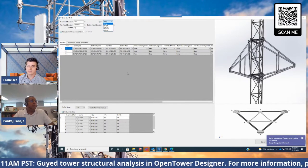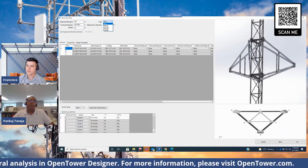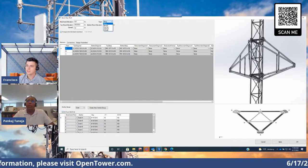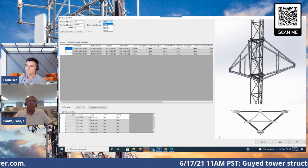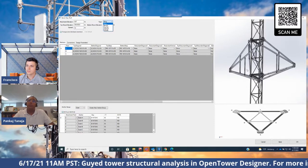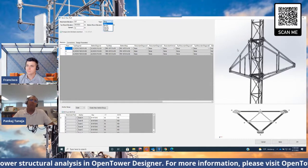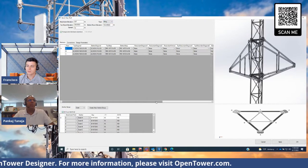Now think about it this way: we have wing style. Wing style has a top diagonal and a bottom diagonal, right? Then I have a top strap member where the upper diagonal meets the tower structure, and then we have a bottom strap. But I have seen that some members are connected to these two diagonals just to reduce their unbraced length in that plane. And sometimes you have plane bracing also. So we put all these different members in the list here.